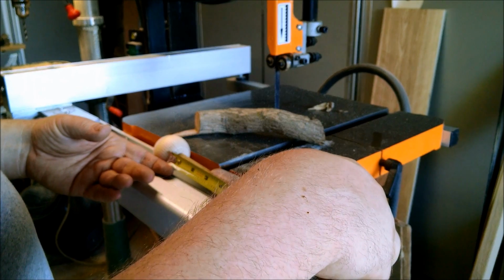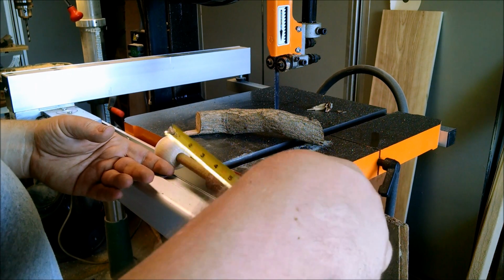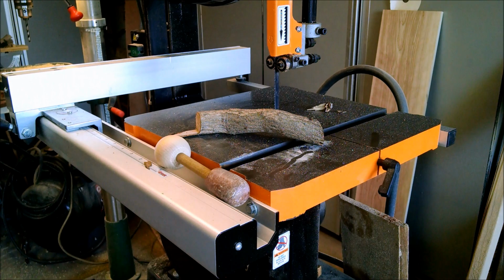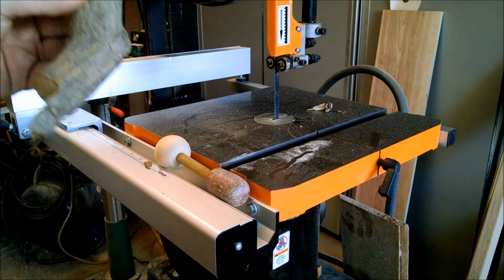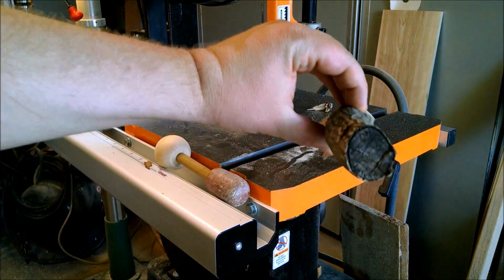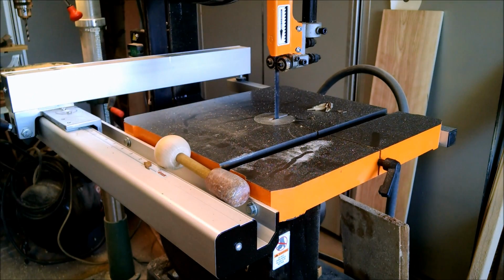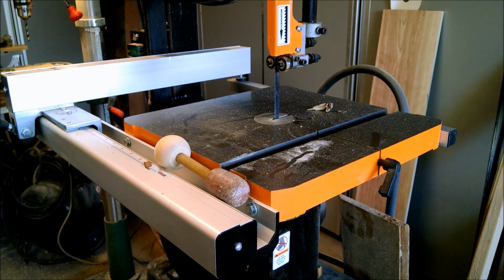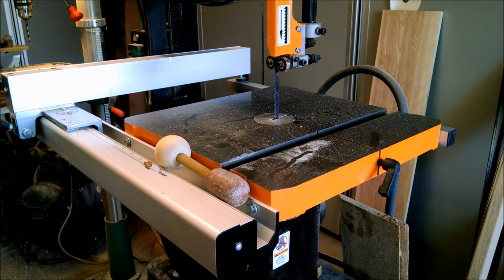So I'm going to cut it at 2 7/8, maybe 3 inches, so I have some wood to sand down to get the right shape. The hardest part is going to be finding a section of this that's straight enough that I can drill a 1/2-inch hole through the center and get it over the dowel that's already there. So, alright then. Be right back.